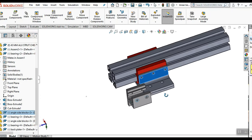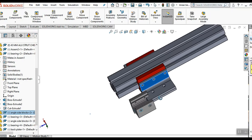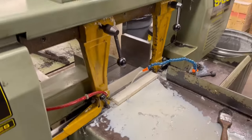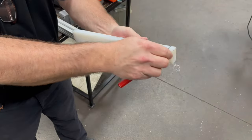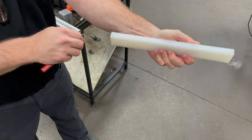I didn't actually design it in SolidWorks first - I drew it up after I made them, and I'll show you the piece of paper I used to sketch mine. The SolidWorks drawings are a little bit more accurate than my hand sketches. Let's take a fast-forward look at how I machined the plastic blocks: basically I took a piece of plastic to the saw, cut it down, machined it down to size, machined the groove inside of it, tapped some holes, and that's our part.